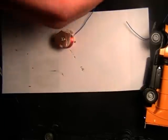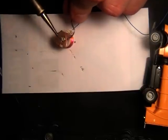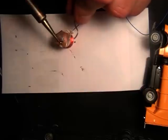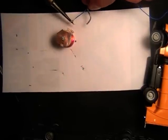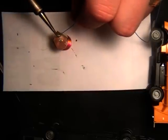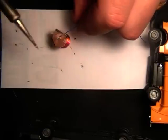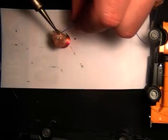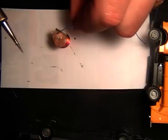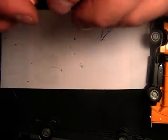It's probably a good idea — the easiest way to try and fix it is just to put a bit of solder on each side. Just tin both surfaces, just leave a little bit of excess on there. You'll know if it's taken. You can just give it a little tug and it should be holding fine.